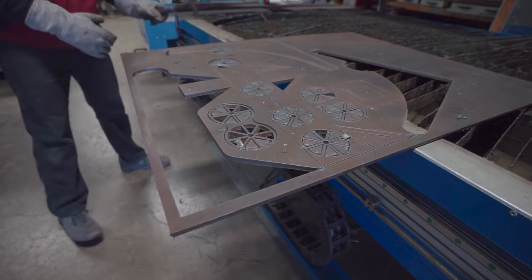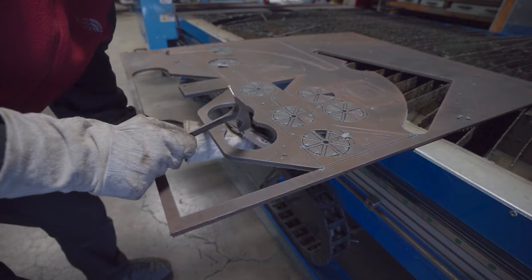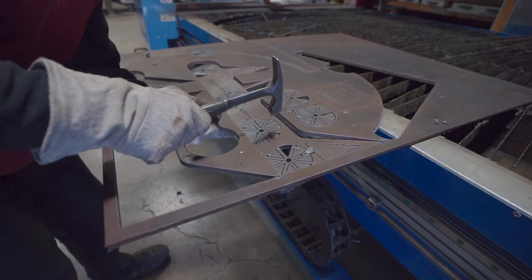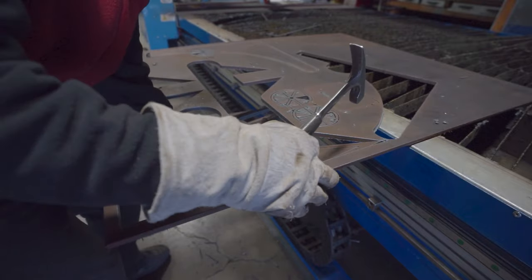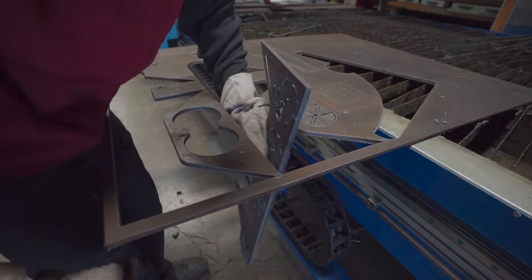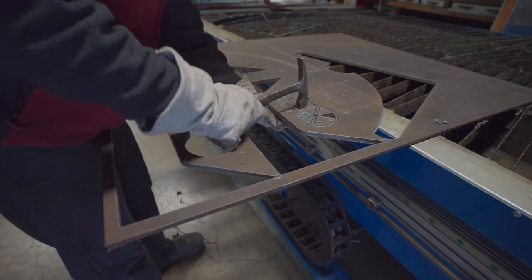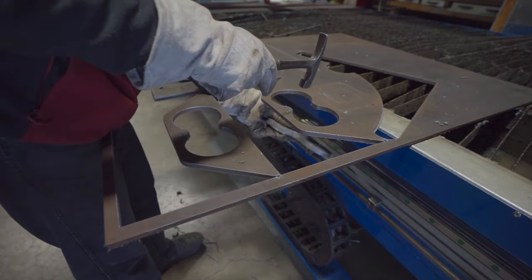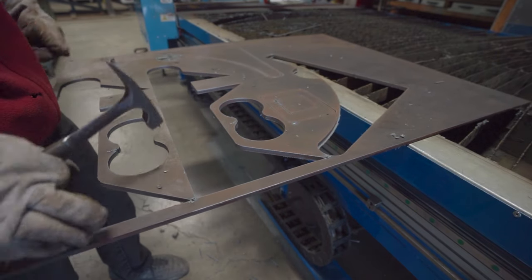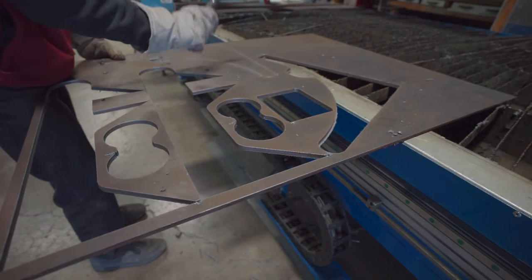The parts that I cut out on this first journey out to the CNC plasma table were the two upright parts, which hold four pulleys and connect the two main uprights of the machine. The two seat parts, which form the seat and have a quarter circle design. The double pulley figure eight style part, which holds two pulleys and enables the machine to have a low row. And the trolley resting part, which goes around the back upright and allows the trolley to not go down too far.